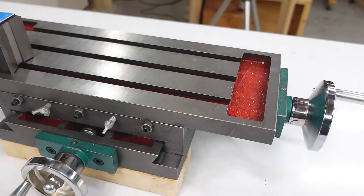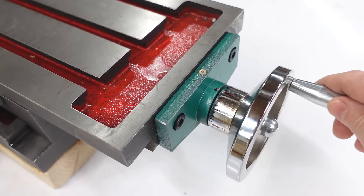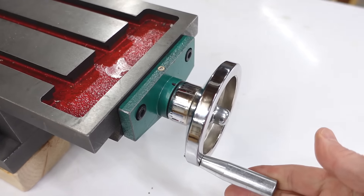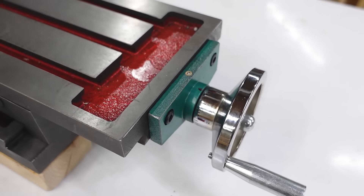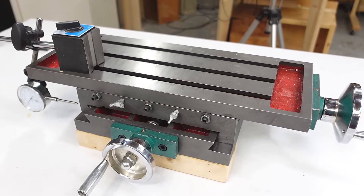And between that lead screw not being entirely straight — even though I straightened it — and also the way I cranked it, I may have caused that lead screw to settle more towards the bottom or not, just by holding it on the handle and turning it. So as I'm here I'm pushing down on this end, and as I'm here I'm pulling up on it, and that may have caused the lead screw to settle differently in that very loose nut.